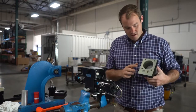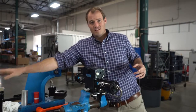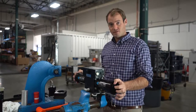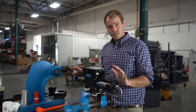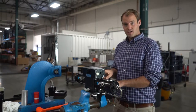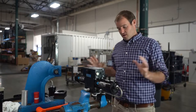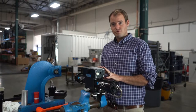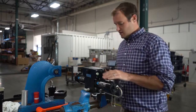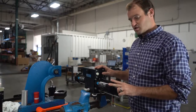This is the cylinder right here. The check valve port O-rings cover these two ports right there, so it's a really easy fix. You don't actually have to dismount the Clark pump — you can leave it on your system. The high pressure fittings on the back here are connected to your stainless steel tubes or tubing to your membrane. If you can leave those connected, that's great, because they can be finicky getting those high pressure fittings back. Pretty much we're just going to leave it here and I'll start uninstalling.